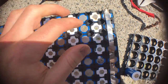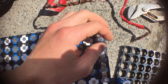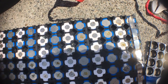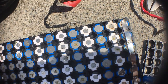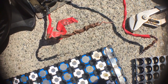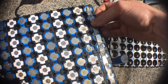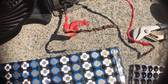I also recommend wearing gloves, which I don't have right now. The positive side of these batteries is always more sensitive, so you want to be more careful not to hold the electrodes down too long. They make welders with pulse width modulation where the power goes in for a very short period of time. Mine is very caveman-like — you just hit the two electrodes down quickly onto the cell. That seems to work quite well for me, and I haven't noticed any degradation from the cells from doing that. I think it all depends on how your welder is set up.